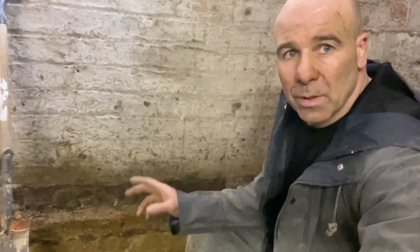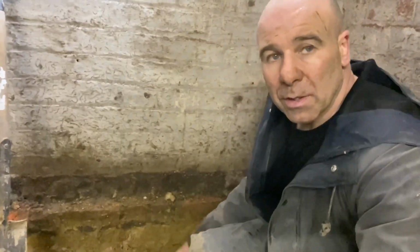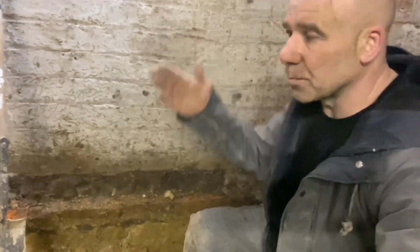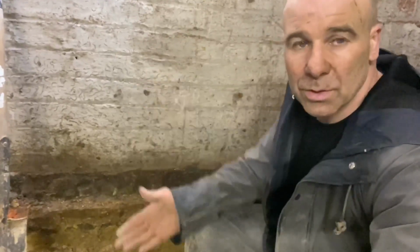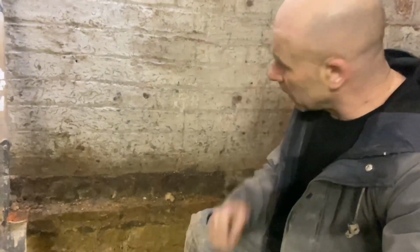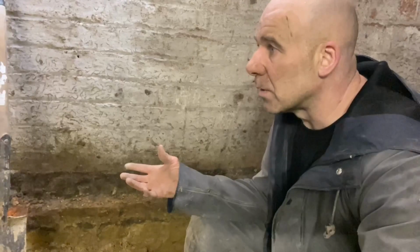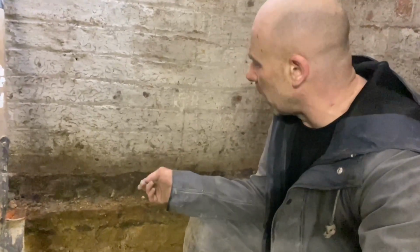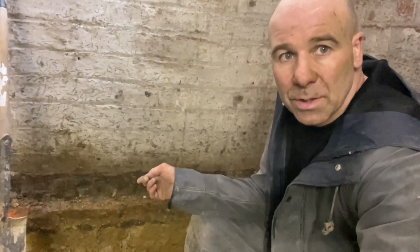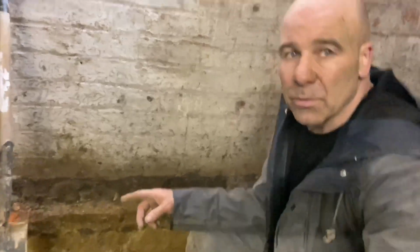footing, or they've gone straight down past footing at brick. Now, what they say is if you leave a 45-degree angle of earth, that should be alright to carry stresses and forces from the wall, a 45-degree angle, and that's what you work on. But it's a grey area, so basic rule of thumb, if you've got to go down lower than footings, then you're going to have to underpin the wall. So that's just one tip for you.